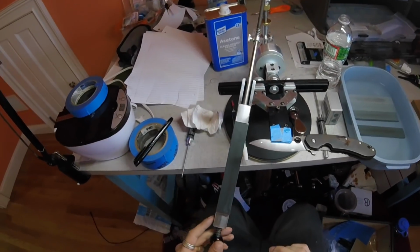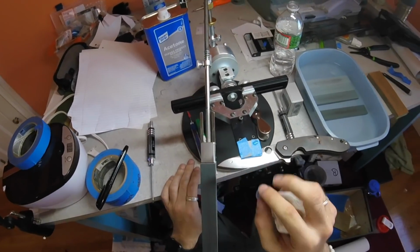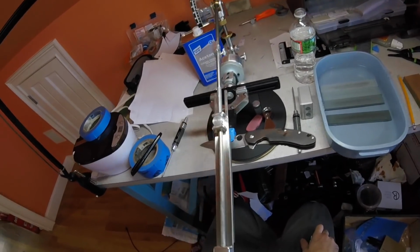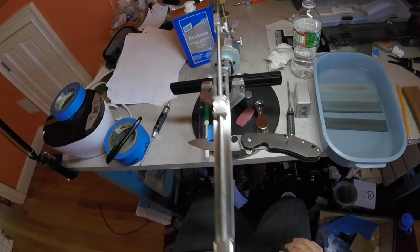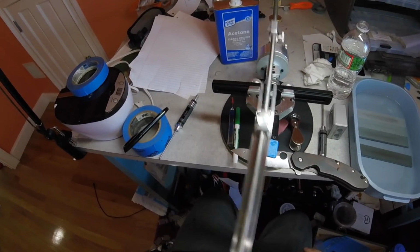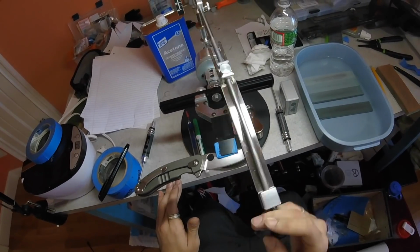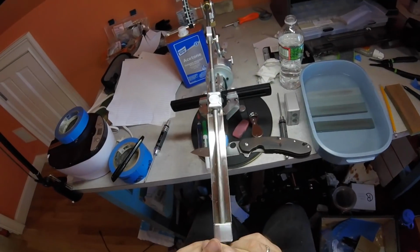So check for your burr, right? What I do is I just take my fingernail. On these early stones, you should be able to just take your fingernail and it'll catch on the way down. Once you've done that, whatever strokes you're doing, now you start doing sweeping. Okay, do this for 20 strokes. Get all those scratches blended together. Okay, switch, do it again, 20 strokes or whatever. Don't overthink it. Don't really count it. Just do this for a while. Keep the pressure lighter and lighter.